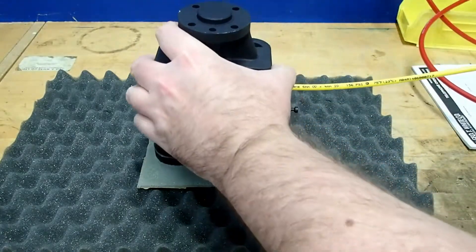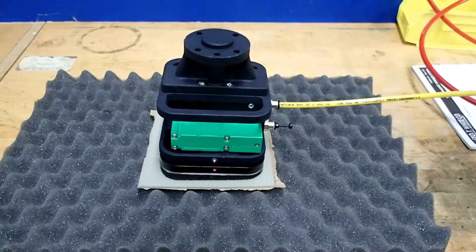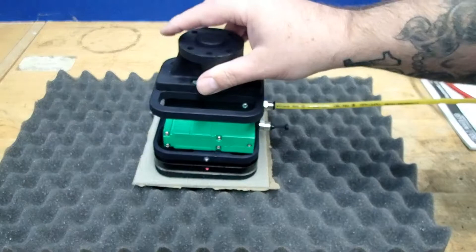Unlike a cup, with a Kinos or an area gripper you want to have the gripper contacting the workpiece before you engage the air. That way you don't trigger any of the check valves or the flow restrictors that are within the area gripper.